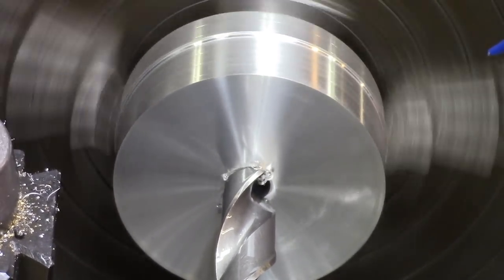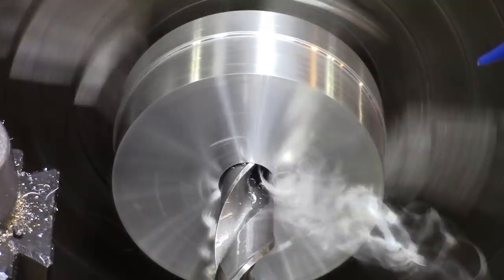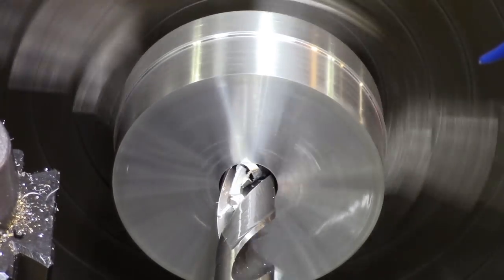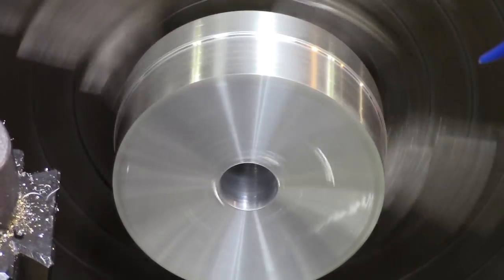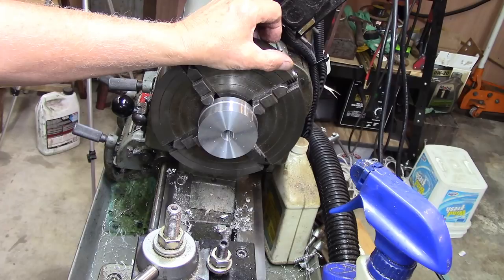This is five-eighths. I can bore an eighth of an inch out of there without feeling like I'm working too hard. What we're going to do is just stop with this drill, set up a boring bar and go after it. My boring bar is still in the boring tool holder, and we're going to bore this thing to hopefully a thousandth under three-quarters of an inch — hopefully that will make it fit nice and tight on that mandrel.